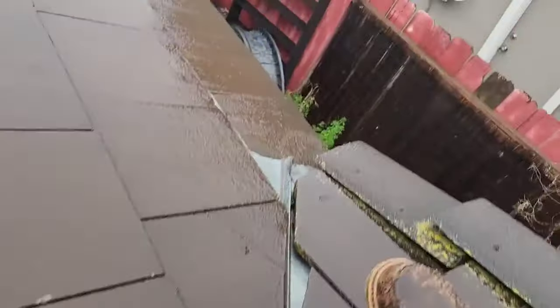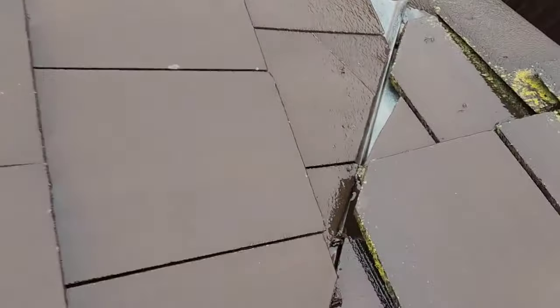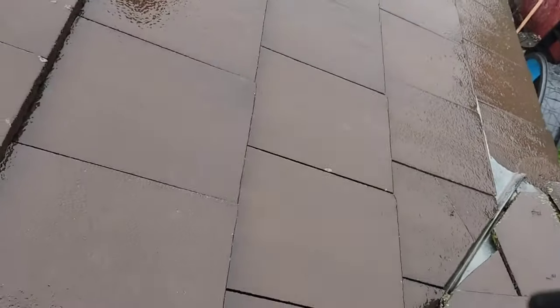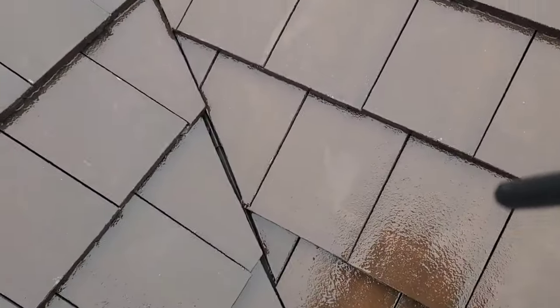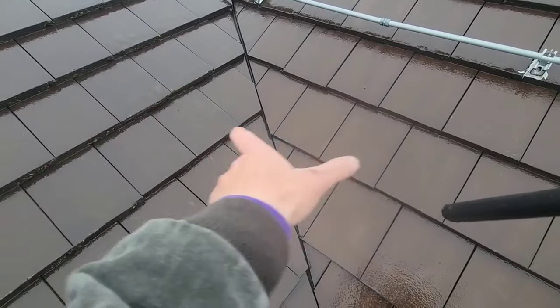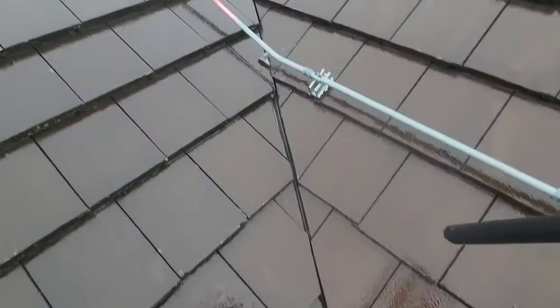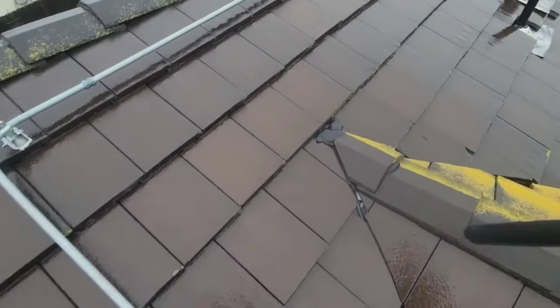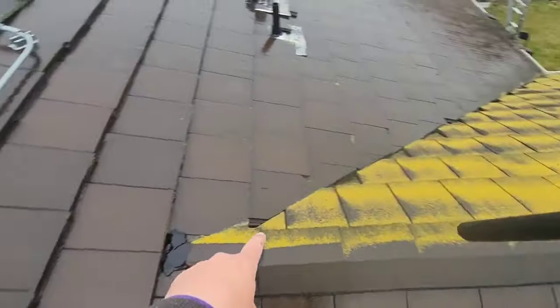What's happening is the water's ponding and then it's working its way off of the metal valley pan. I would recommend a roof maintenance come through that would secure and seal all of the roof jacks. We'll open up all the valleys here — we'll take all these valleys out, open them up, expose the 24-inch valley pan.